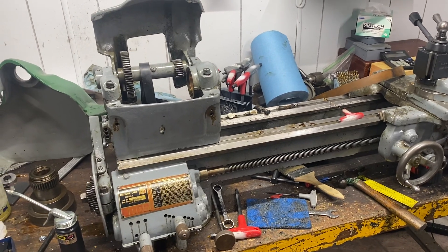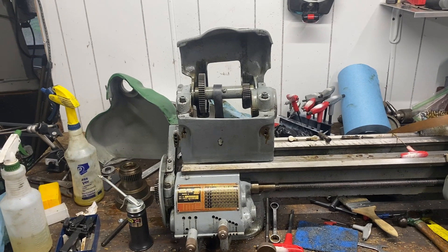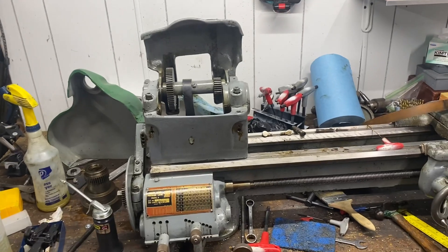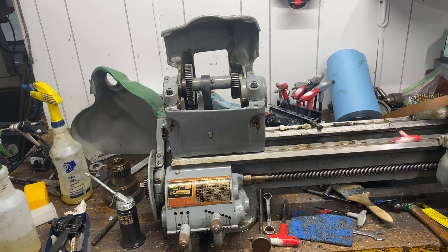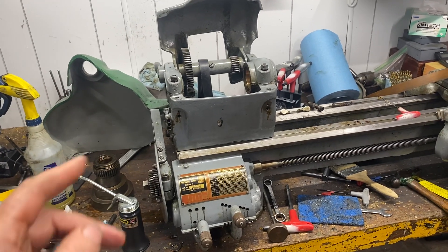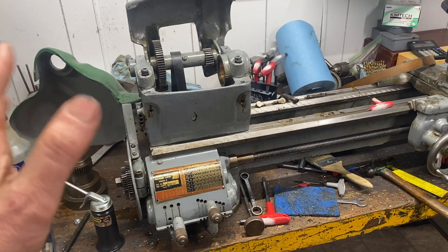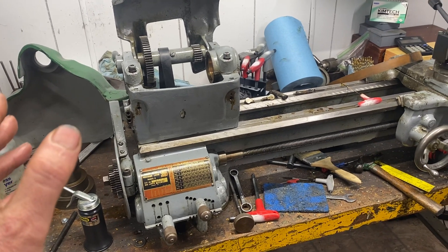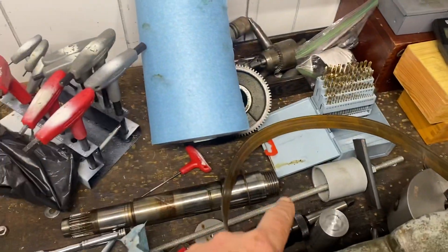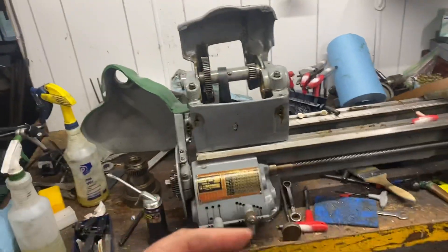It's a little South Bend. I've never pulled a spindle out of a lathe before because I've never really been in need for it — so an all new job to me. I watched a few videos online about how to do it. Somebody was actually commenting on one of my other videos about how you could knock this out with a hammer. I'm glad I didn't go that route. I actually made myself a little puller out of all-thread. Here it is — only took a minute to make and I was able to squeeze it right out of there.